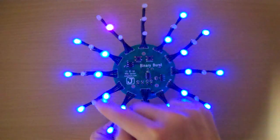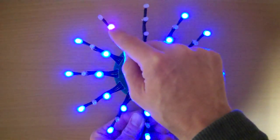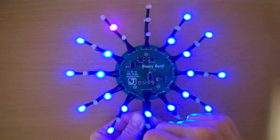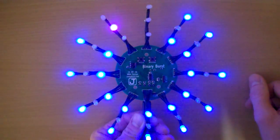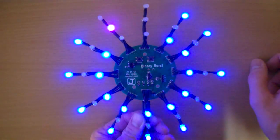And then in the center, these are bi-color LEDs. This one is both red and blue right now, which means the red is the hour, so that's 11 o'clock. And then if you add up the fives, you get to 50 and then two minutes. So in another minute, this won't be two colors anymore. But yeah, that's how it works.